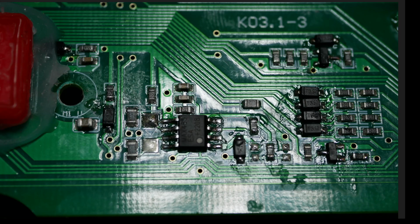And yet if you look over here at these 8 resistors right there, you can see how nice and even they are. You can see how even the solder connections are. That is classic reflow machine soldering. And these ones got flux all over them. Even 2 of the 4 diodes are crooked. Yeah, that is classic signs of hand soldering. When I hand solder, oftentimes I get parts a little bit crooked like this because hands aren't as steady as machines are. Clearly this transistor was replaced. Clearly this part, this diode, and this transistor were replaced.